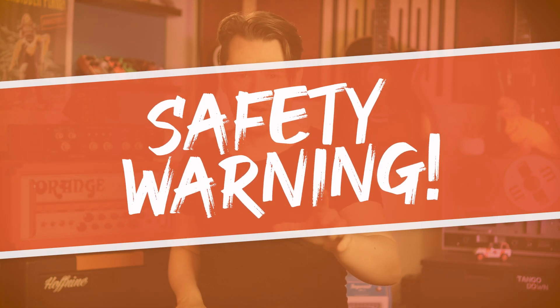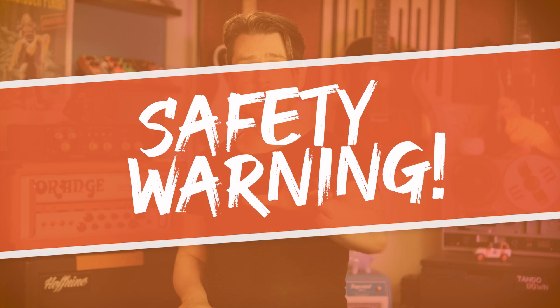Now a safety warning before we go any further. Some people, no doubt already down in the comments section of this video, will be suggesting that all you need to do is disconnect the ground pin from your mains cable and that will make all your hum problems go away. Unfortunately that also leaves you vulnerable to electric shock if any fault were to happen inside your amplifier and the chassis became live. Never, never disconnect your ground connection from your mains cable — it's there to save your life.